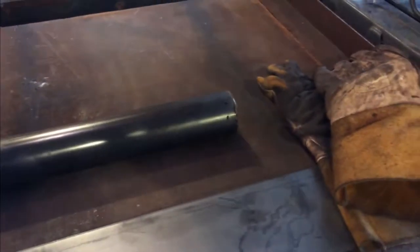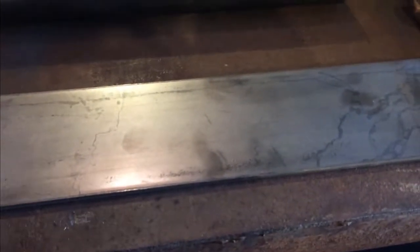While the cement's curing, I grabbed a piece of the drop here and I'm gonna make the feet for the legs that don't go on concrete. I think I'm just gonna make them squares. I'll go corner to corner and put my holes in each corner. Pretty standard layout procedure.